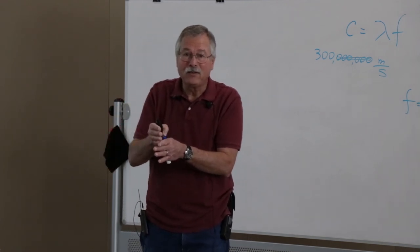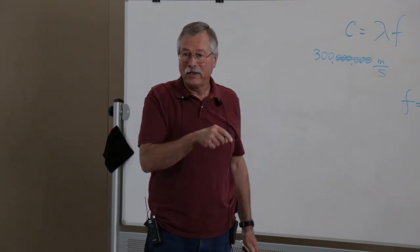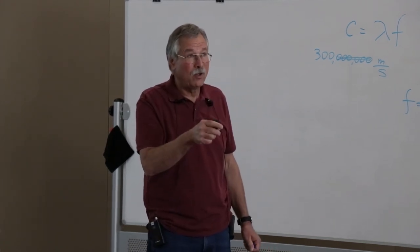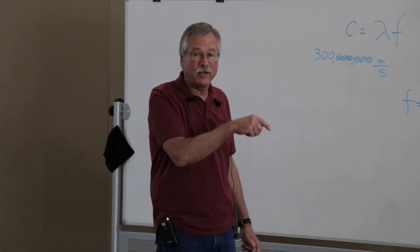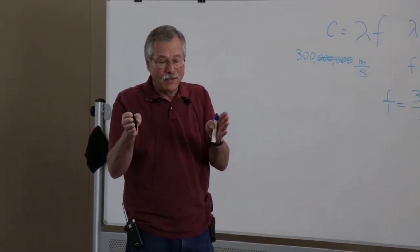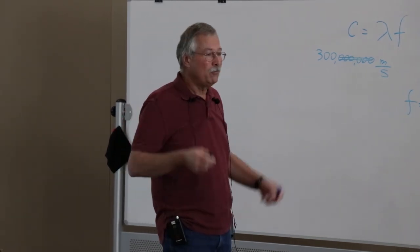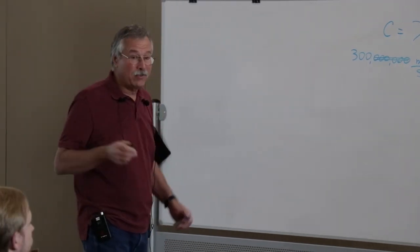On FM, we've got what? Stations every 200 kilohertz, right? 107.9, 107.7, 107.5, 200 kilohertz. Those stations have 100 kilohertz in which to play. So much, much higher fidelity. Of course, they have sidebands too.